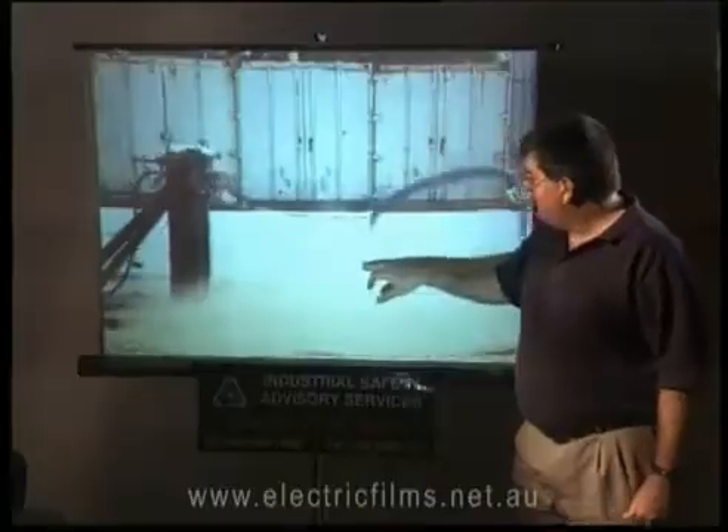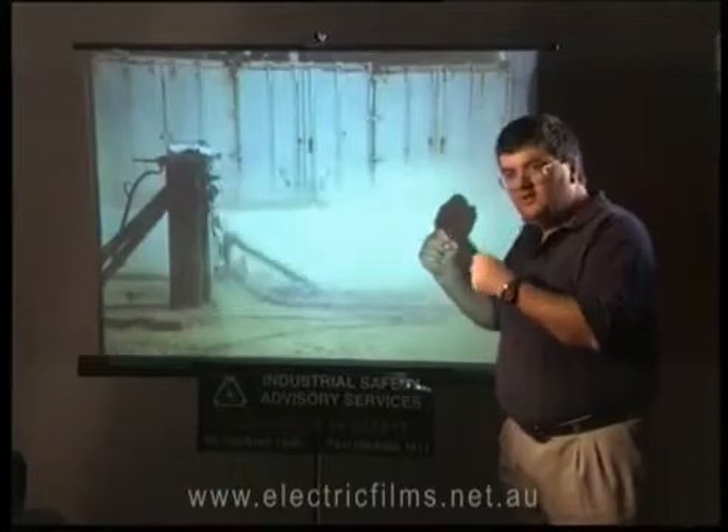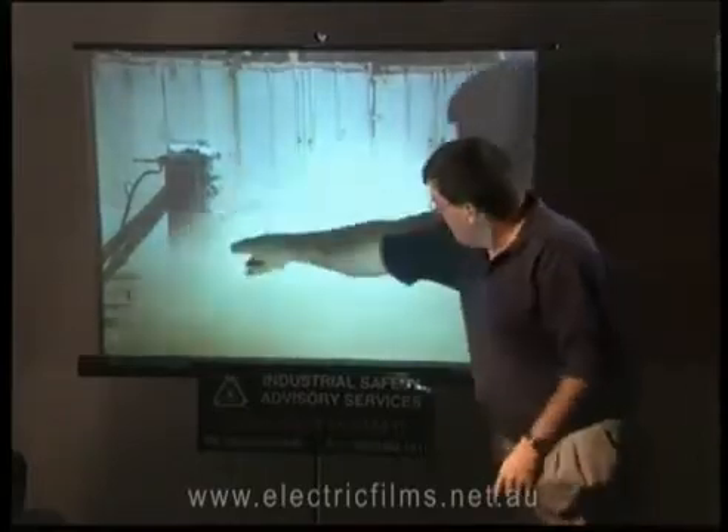This was considered likely due to the shock-absorbing characteristics of the hose. As can be seen in the slow motion video, the hose fitting travelled past the end of the whip check before the whip check took up. The resulting loop in the hose therefore absorbed a significant amount of what would be considered normal shock loading.